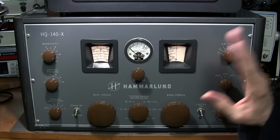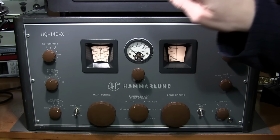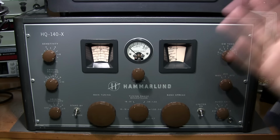And that's right at the center of the IF curve right there, or right at the crystal frequency. As I move away, you'll be going down either side of the slope on that IF curve, and it won't be as sensitive. That's why it's so crucially important to have the crystal frequency right at the peak of that IF curve. So at any rate, that's how the receiver performs.